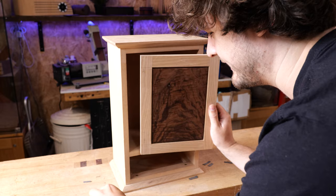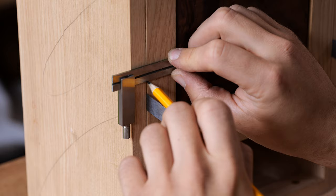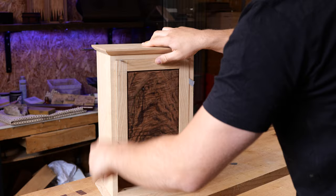I've done 'A' on the leaf that only has two pins — the one attached to the carcass has three pins, and this is generally the way you want to go about it because it helps resist the door from sagging. We'll offer hinge A up to that line and put another pencil line at the bottom, very faint, just to give ourselves boundary lines, and the same for B. This ensures we don't scratch the marking gauge too far up the door. Next, fit the door into the carcass with all the shims in place, lock it in, and carefully carry those lines across to the carcass as well.